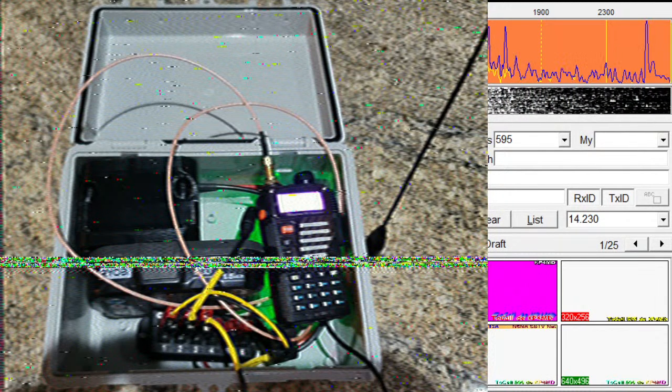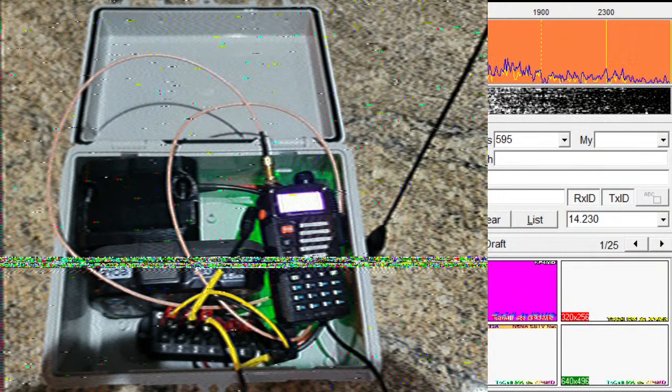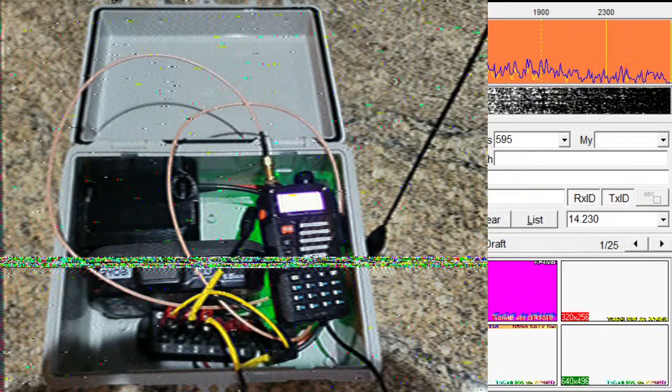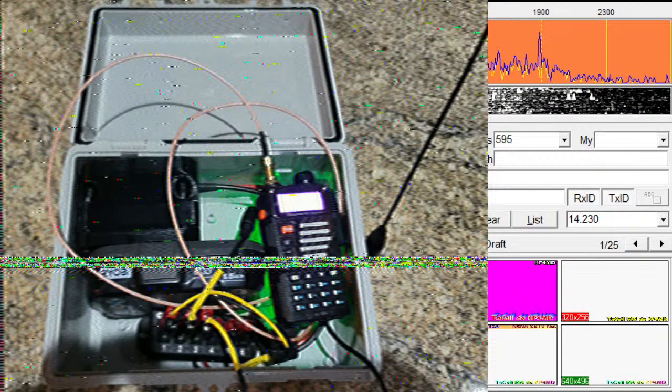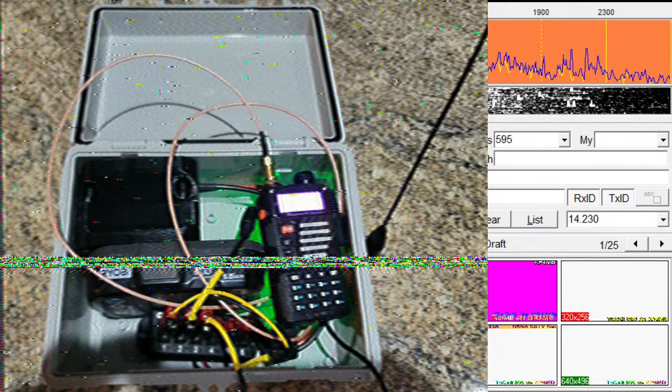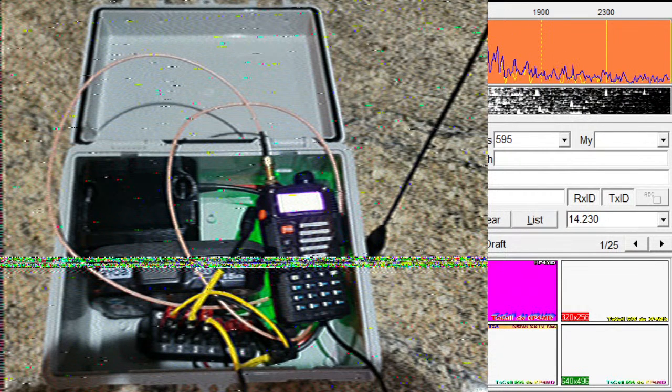A number of these were available on the surplus market back in the 70s. They were all discrete transistor units. That was, I guess, before large-scale integration came around. And so I picked up one of these boards back in the 70s, and I had it for the longest time. It was crystal controlled, reactance modulated across the crystal to get frequency modulation.